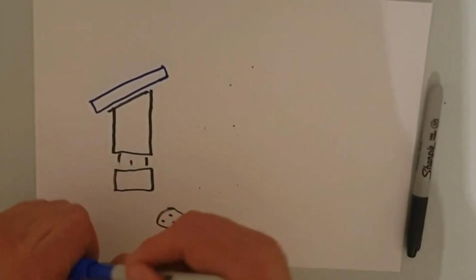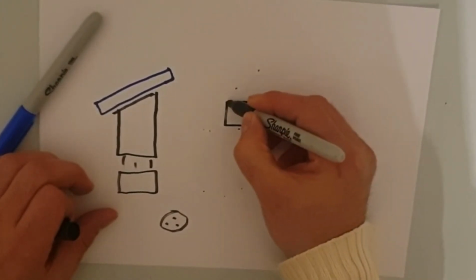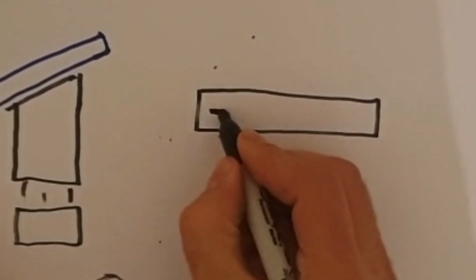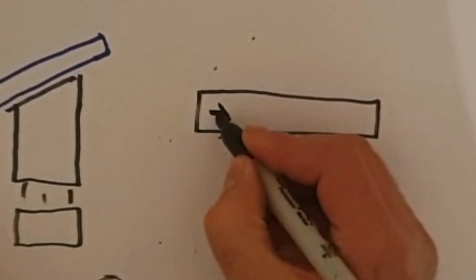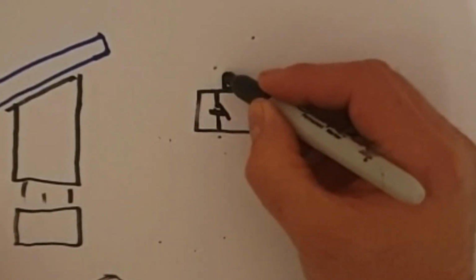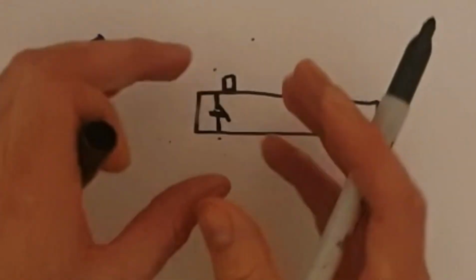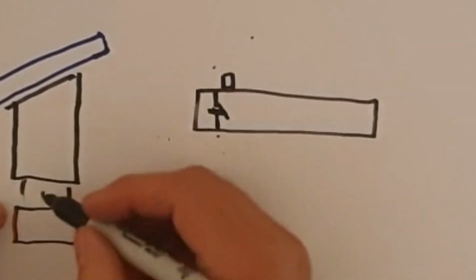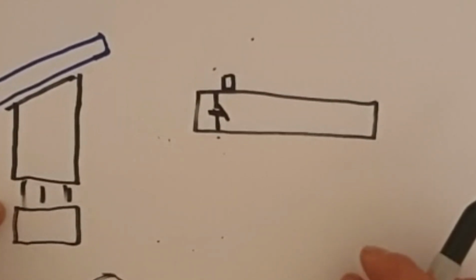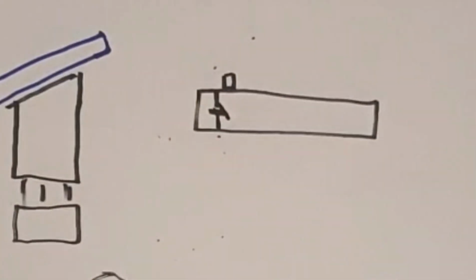And when you have your telescope, this will essentially just sit at the front of the telescope like this. It's going to be held in place with these threaded rods, and your eyepiece will be here, just like in the picture at the beginning, and you'll look through and you'll see this. But this has to be able to move, you've got to be able to tilt it, and that's why we're going to have these screws here, which will allow you to adjust the angle of the actual mirror. Let me just show you the actual aluminium rod that I'm going to use.